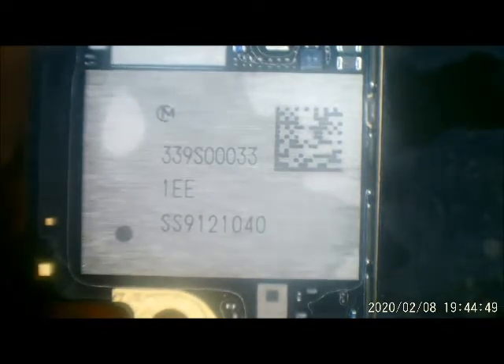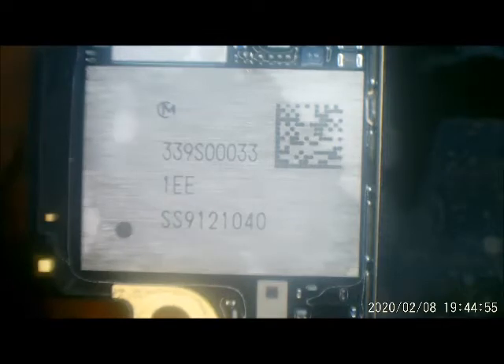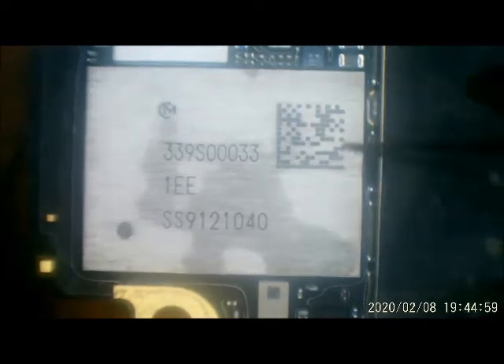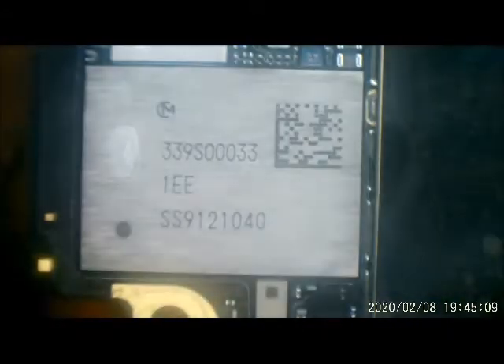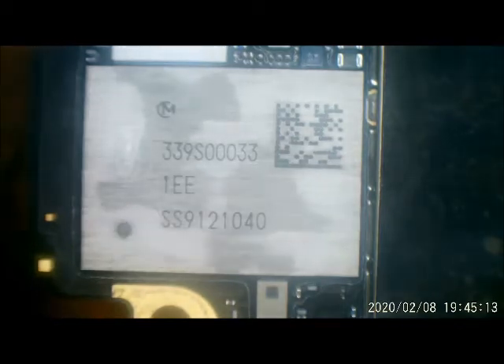It's actually a short circuit in the Wi-Fi chip. The first sort of heat you can see in the top right-hand corner is what a lot of people think is the issue, but there's another section that gets hot. I'll show you again where I've just marked so you can just see it getting hot when I put the power on.